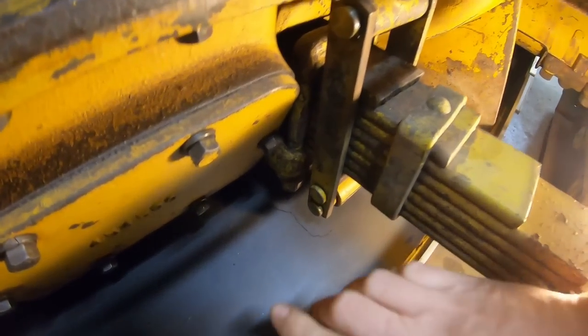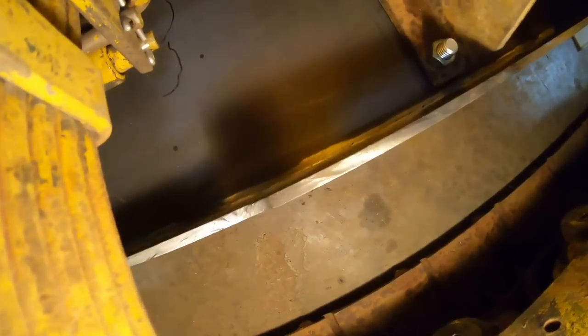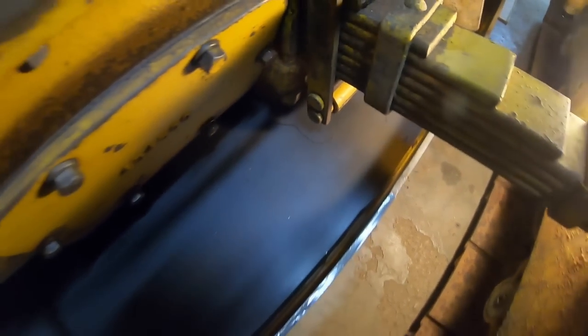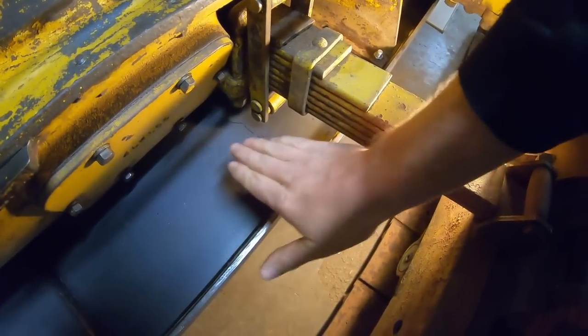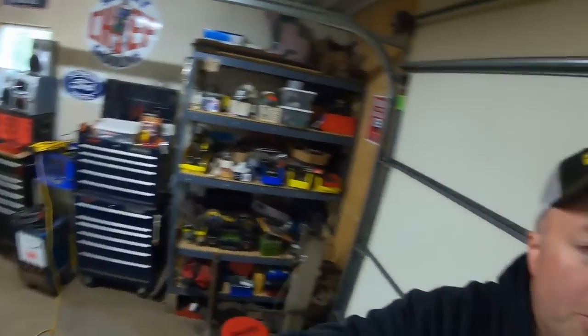And now for the holes that need to go beneath the main and equalizer springs, you can see for now, I've just taken a marker and traced out kind of around the corners of the equalizer spring and pins and links and everything where they are closest to the pan. That's just going to give me a rough idea where everything is landing once I take this pan out from underneath the tractor. And because the beer can pan out back has been completely cut away in that area, that's of no use to us. But the pan that's underneath my 5U7066, the Iron Mistress, that still has all those holes in place. So we're going to have to get under that, tap out a pattern.